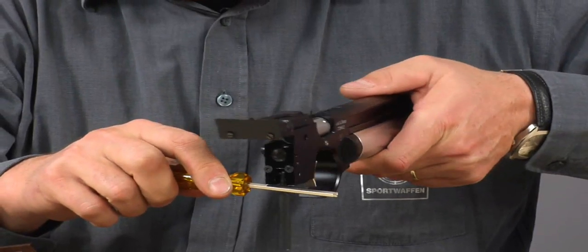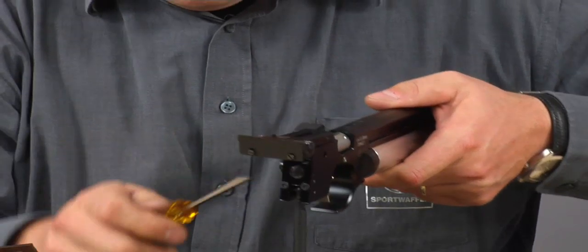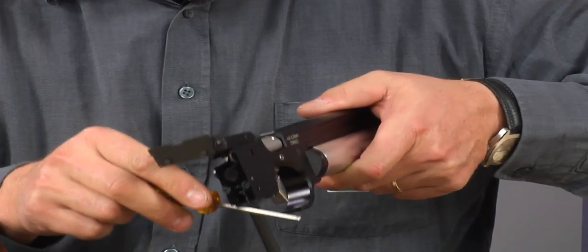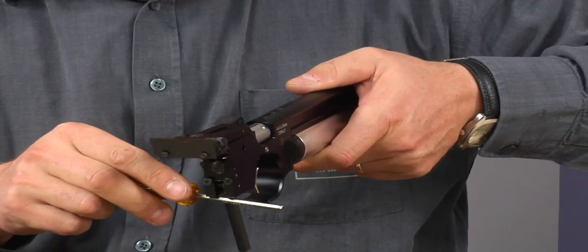It is important that only one adjustment of the two pairs of screws underneath the housing is made. This adjustment can be either on the same side or on opposite sides. An adjustment at the same time in height and to the side, simply using the screws underneath the housing, is not possible.